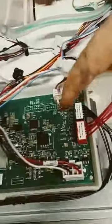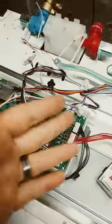Mine is working now. I'll tell you what I did. I had to pull this white backer off, pull all the plugs. I had corrosion along here and back here. Didn't need the new fill valve. I used a toothbrush with some vinegar that I put in the lid and scrubbed right along here and back in here, then dried it all out.